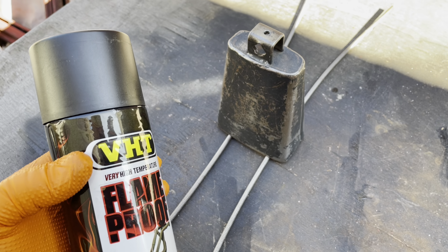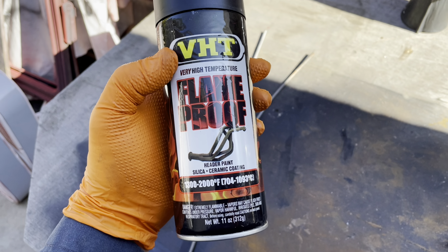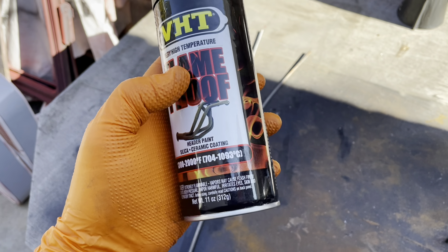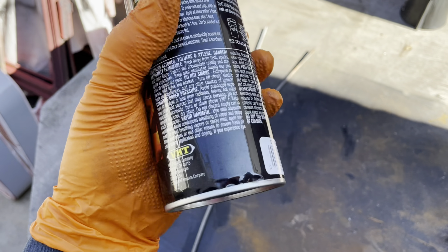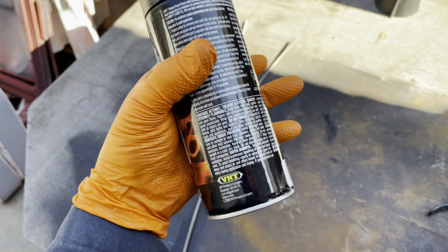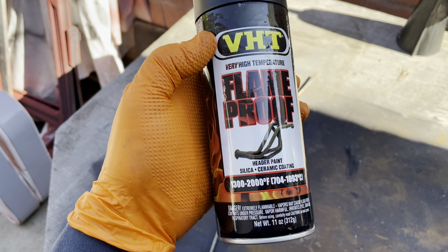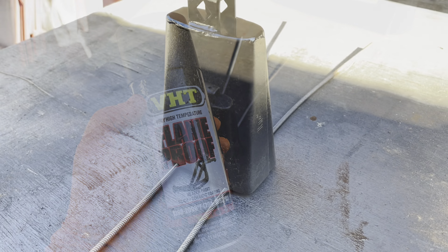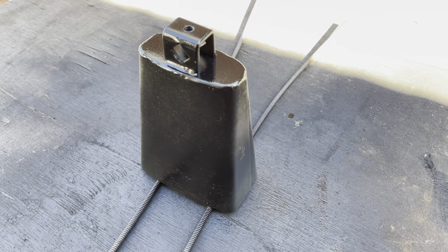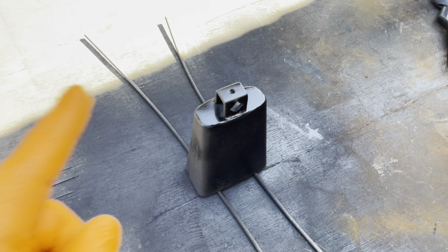We're ready to paint the cowbell. I'm going to use this VHT paint — I just happen to have some left over. You don't have to use high temperature paint, but I like this VHT stuff — it goes on well and you can use a heat gun to cure it, dry it on, and it's going to hold up. I'm using a flat black — you can do satin. This is also a rust inhibitor, so you don't need a primer. The bell is super clean, let's go. That's our first coat. Paint thin coats. I've raised it up on a couple springs just to allow air to move around the bell.